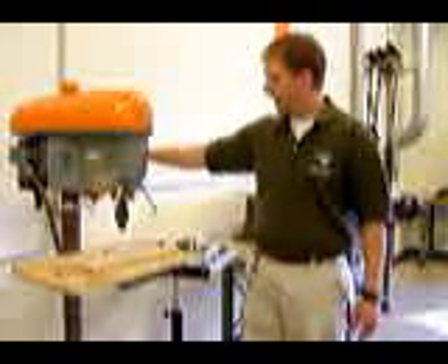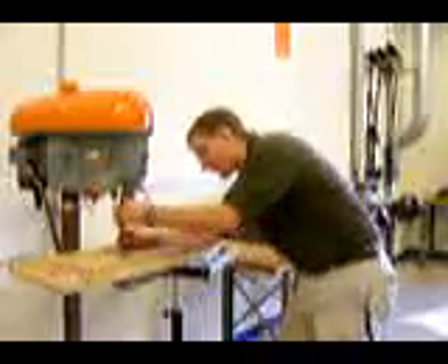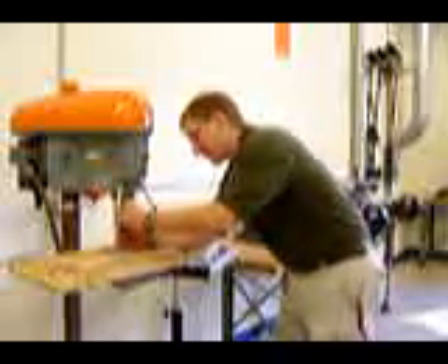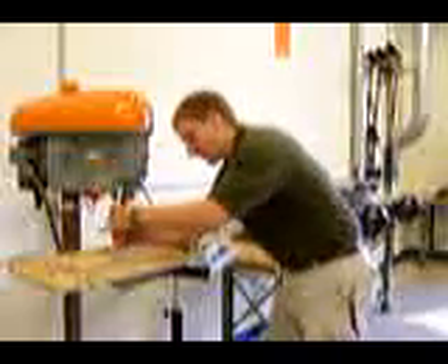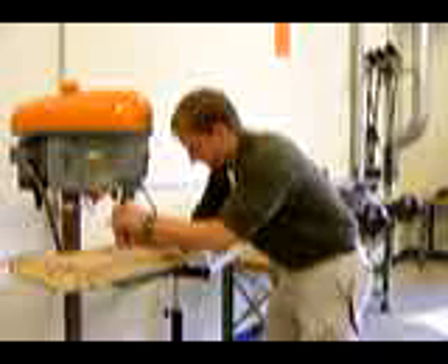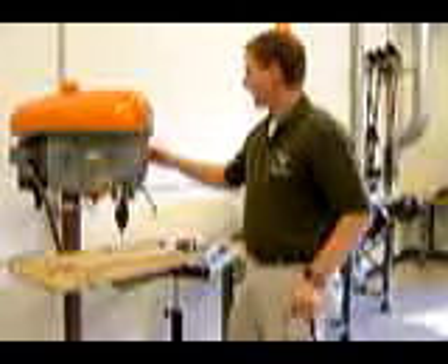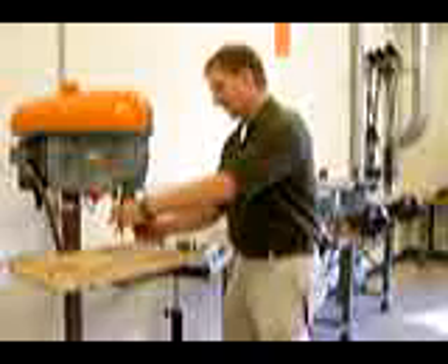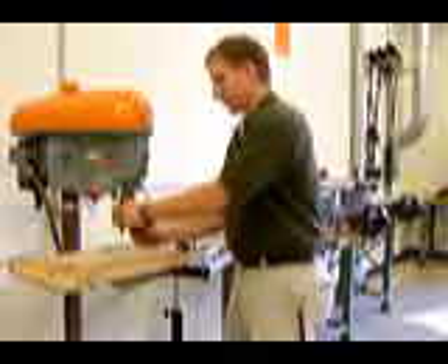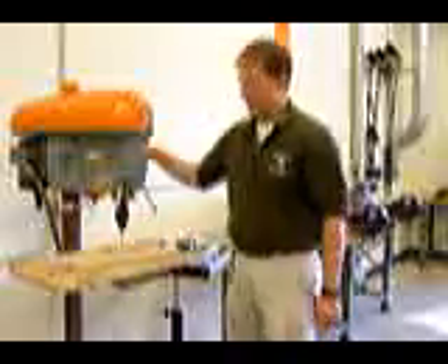In order to put a drill bit into the chuck, you select the drill bit and put it into the chuck — this part is called a chuck. Basically, you get the drill bit seated in the chuck. Once it's in, you use a tool called a chuck key. You go into each of the three holes and give it about a quarter of a turn. That will assure you that the drill bit is straight and tight, and the drill is in the chuck securely.